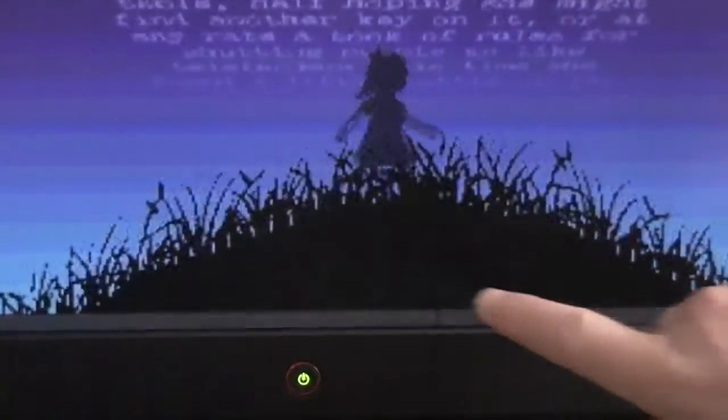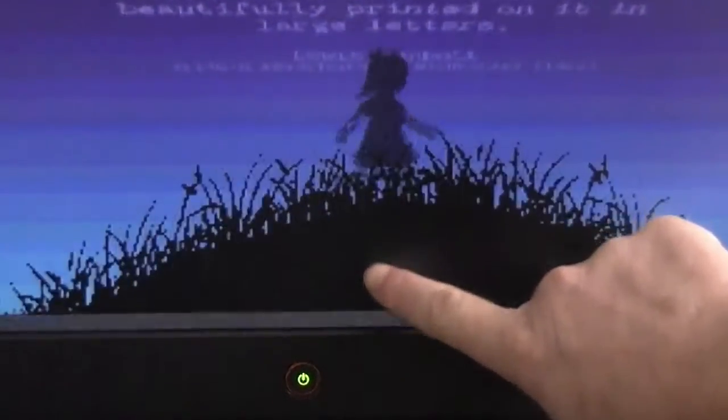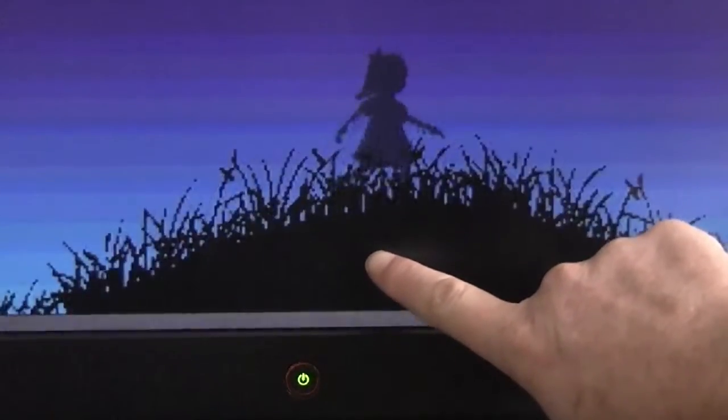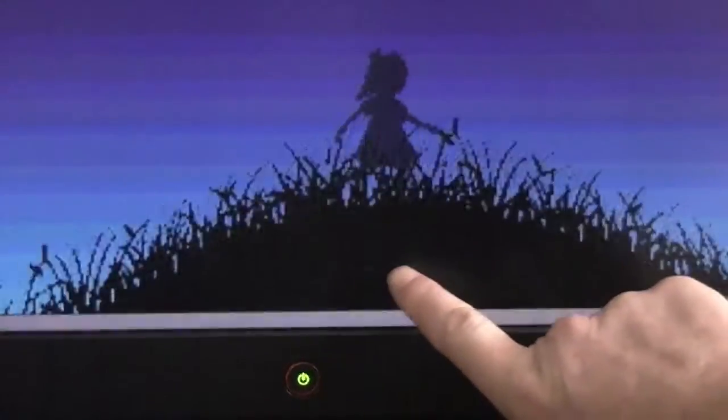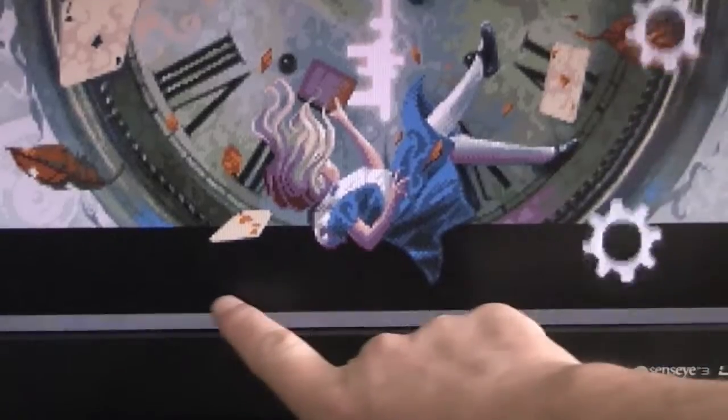Now again, I'm not sure if it's going to come up, but in this dark section here there are little flickering white dots just by my finger here, and you get this with this scan doubler wherever there seem to be large patches of black. So it's even apparent down in this border section to the left and to the right of the visible area. You get white dots.